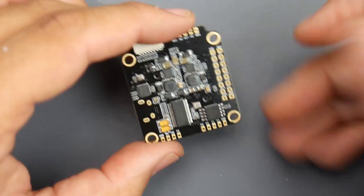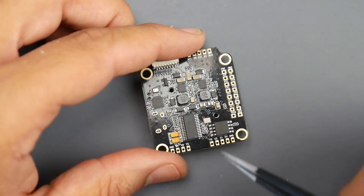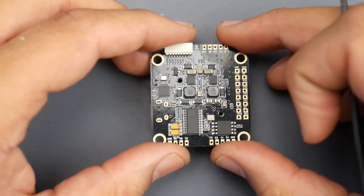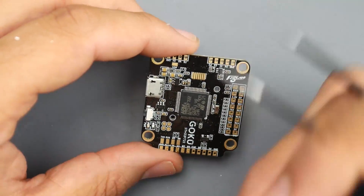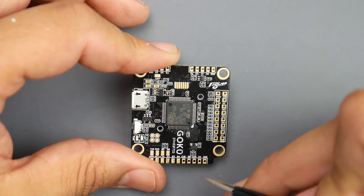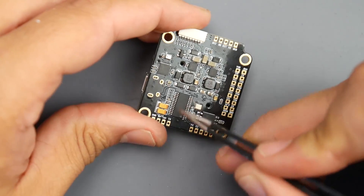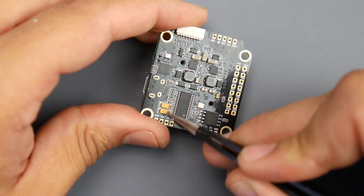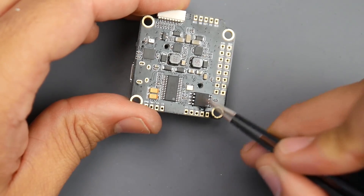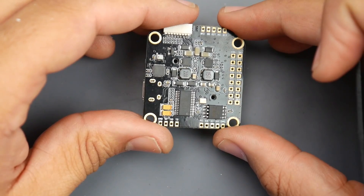First, it has a 9-volt regulator for your video transmitter. That gives you a very high probability of good video feed instead of having those lines in them, and it does help reduce the overall noise coming into your video feed. Not only that, it has dual-camera switching capability, so you can actually install two video cameras on this. It also has a barometer, as you can see right here. The OSD is rocking really nice fat tantalum capacitors, and we also have some memory for black box logging — this is a 16-megabyte flash memory, which is really great, especially since this does not have an SD card expansion.